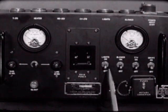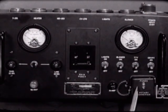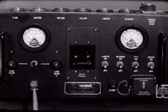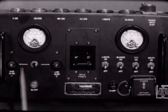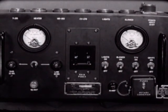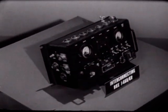The interconnecting box J-668 also features various power on/off switches, fuses for the rotary converter and other circuits, a function selector switch with controls, and main power circuit breakers. In addition to providing complete interconnecting facilities, the J-668 also functions as a master power control for the AN/GRC-46.